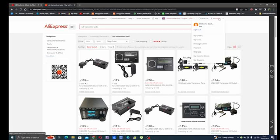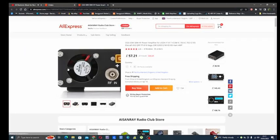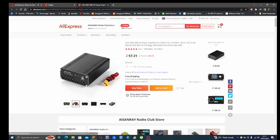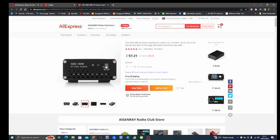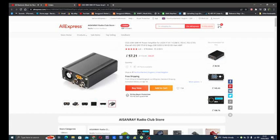He's always advertising. My orders, for instance, I bought this, £55. It's a little HF linear amplifier. No buttons, nothing. Doesn't need a transmit lead. It's RF sensing. No more than 5 watts into it. And it's a times 10 multiplier. Obviously 1 watt equals 10, 2 equals 20, and so on. I've had a few QSOs on that. No comments on audio yet, but they've all been activations, so I couldn't really give a true audio report. But cracking little bit of kit for the money.